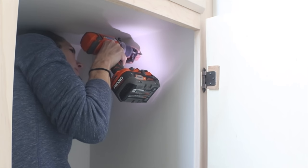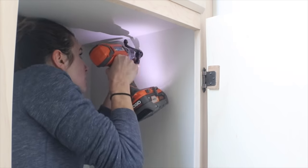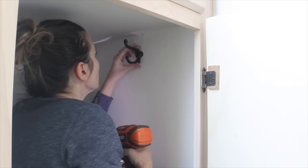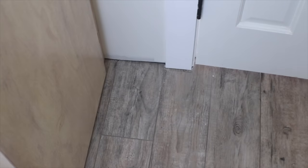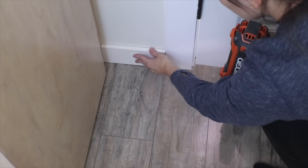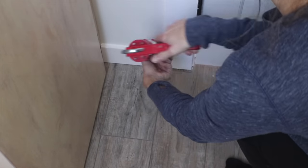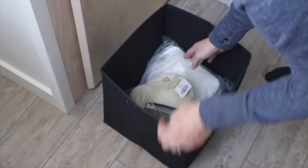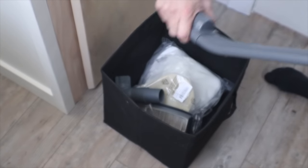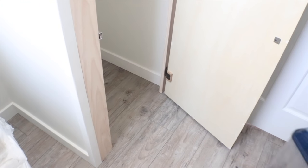I'm going to add a couple of hooks on the inside just for some more usage and versatility. I might later on add some baskets on the back of the door as well — that might even hide some of those hinge retrofit pieces of wood. I also added baseboard trim work where appropriate: I measured, cut, and installed some little MDF baseboards, got those nailed in and caulked, and it looked great. This closet is going to store vacuum stuff — I have a bunch of filters and things — and I'm throwing in a basket on the top shelf for things I don't have to access super often, making it kind of a linen slash cleaning closet.